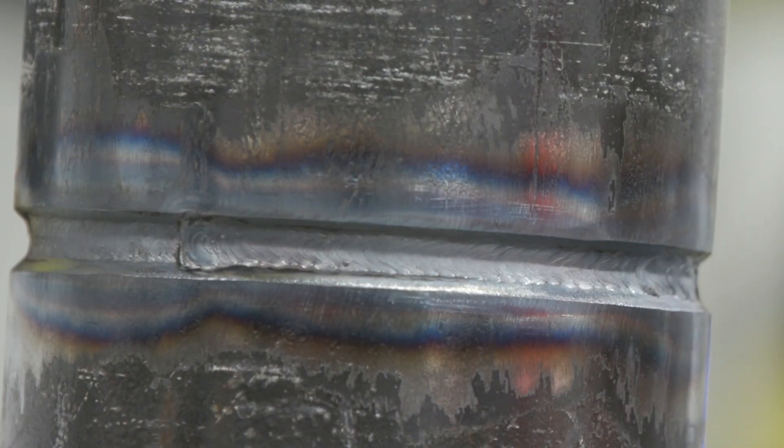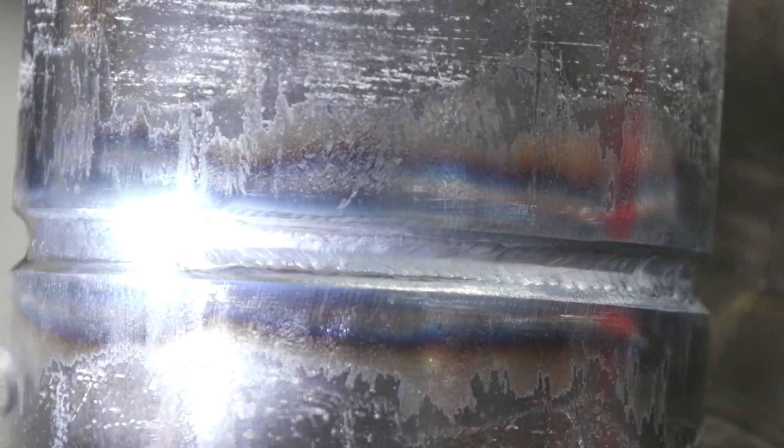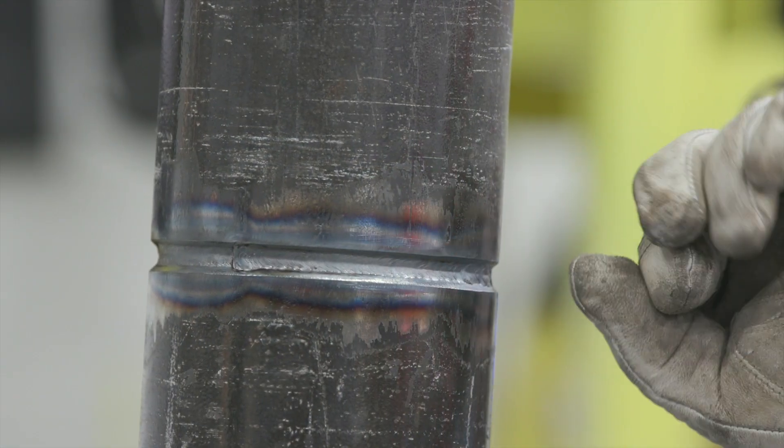I like to have just a bit more reinforcement, but the wall thickness is broken down on the inside and I've got just a little bit of reinforcement — I'd like to have a little more, but it works. To correct that I could have that gap open a little bit more and use a smaller wire, feed more wire. But this will work. Again, horizontal roots — we did two methods here: we came off the side and rested the heel of the hand and kind of slipped along, and then for the second part we walked the cup the rest of the way.